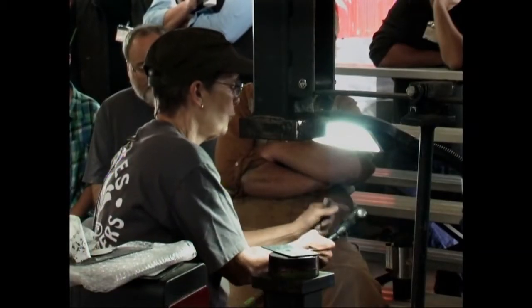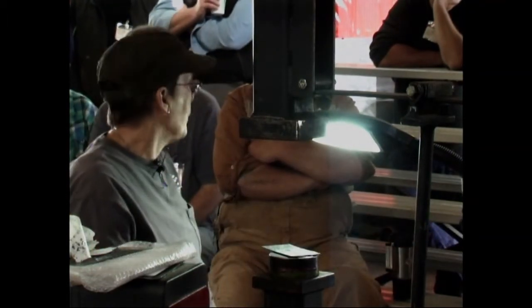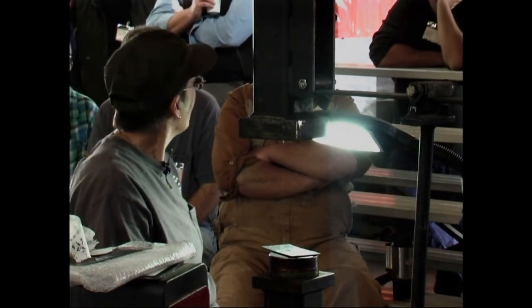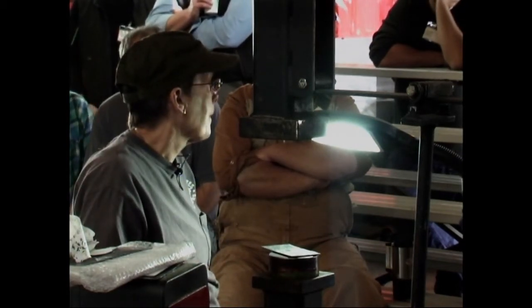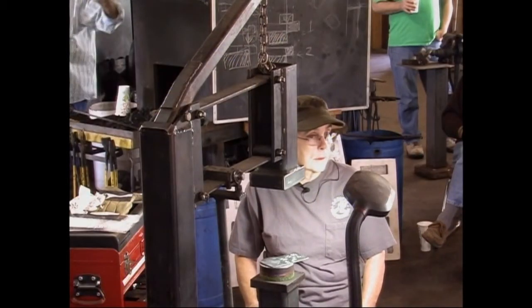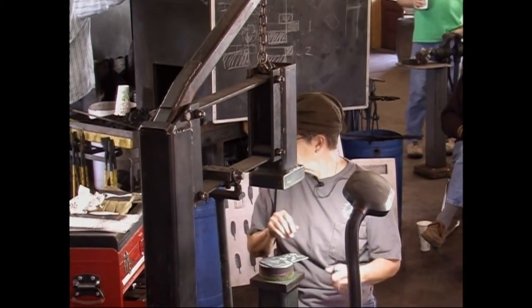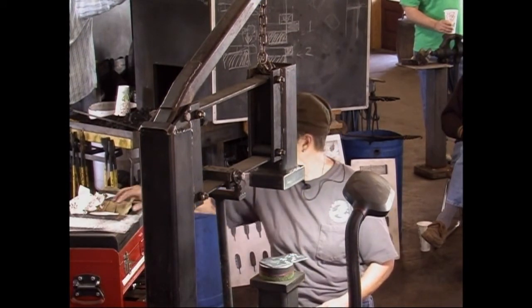You can see this thing has been dressed, no sharp edges, nice radius, you can pass it around. I use it under my treadle hammer a lot when it's hot, doing hot work. No, I'm not hand hammering. This is doing all my work. If you look at this, the sides of this describe a smaller ball, and the top of that is a much larger one. It's not 180 degrees, it's a lot flatter on that ball. I can take a piece and show you what happens. Let's do that right now with a piece of lead.